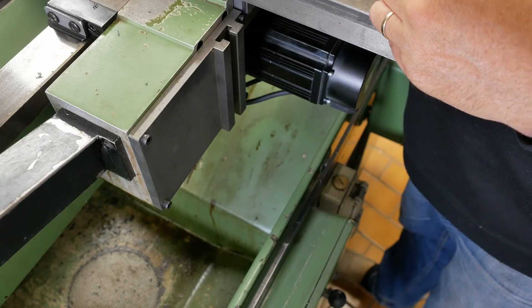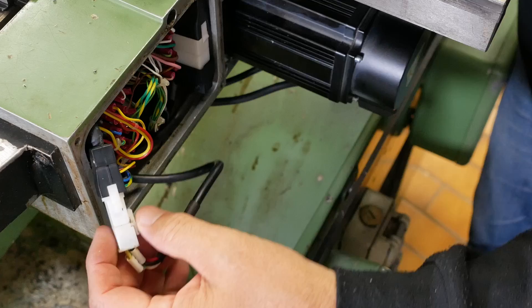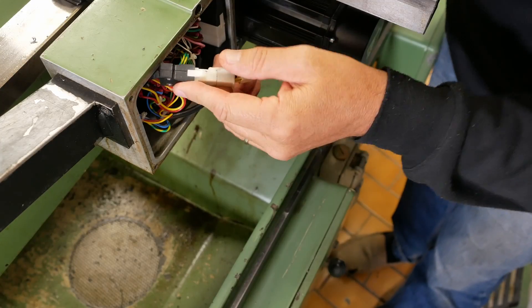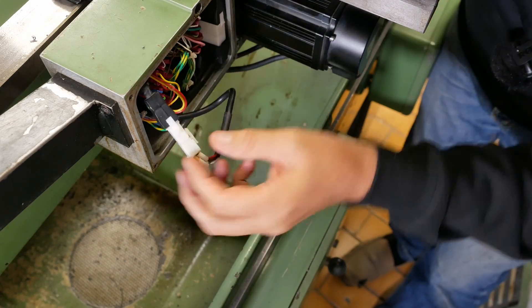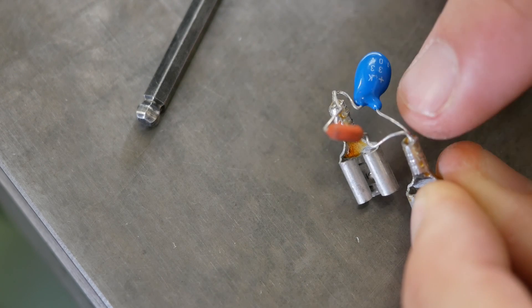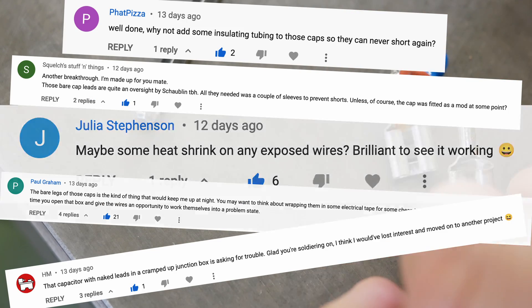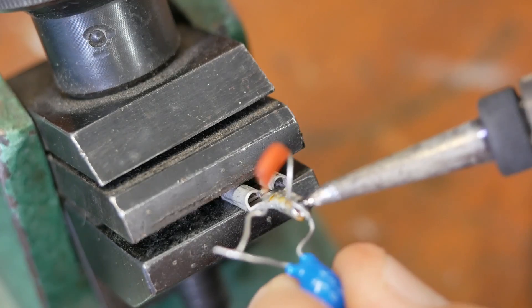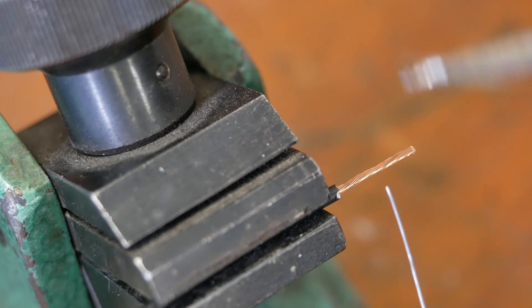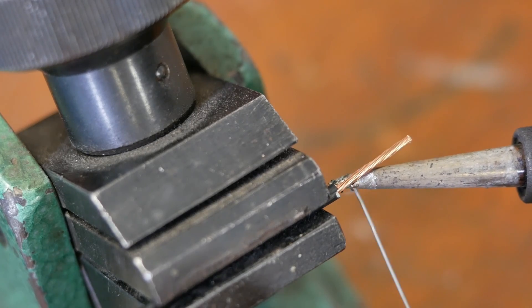While I'm still doing wiring, last week I found and fixed a short in this junction box. While I fixed the short, I didn't really fix the cause of the short, which are the leads of a couple of capacitors being exposed, so let's insulate them. I think I'm going to extend these with a bit of wire on each leg because that way I'll be able to get proper heat shrink over them.